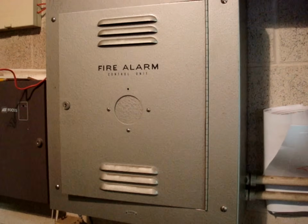Now, next to the master control panel is an extender panel, also standard electric time, and we'll open that and look at that. Here we have some more resistors. These three here are fixed resistors. Looks like we got a 20, a 5, and 45 ohm resistor. And again, we have a couple more relays. And then the terminal hook up here at the bottom. And there's another relay there.